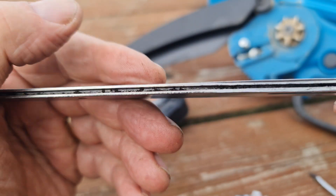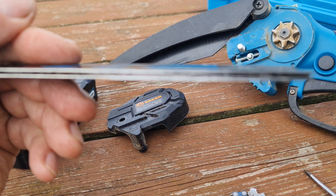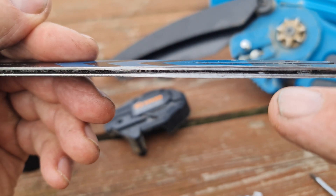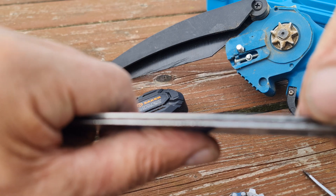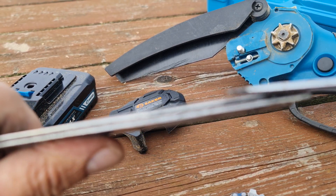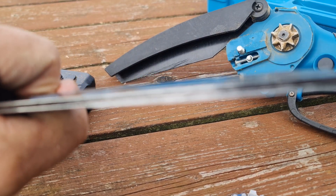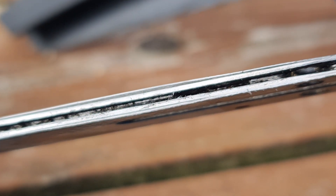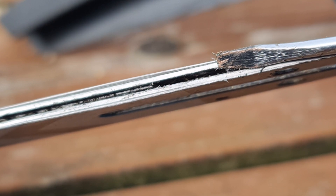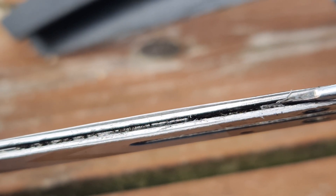What's happening is you can see it's wearing the blade and causing a bevel — it's worn down the blade right there. It's causing a groove on top and bottom. Can you see it? It's making the chain dig into it and the gap is shortening between here because the groove is bending over and jamming the blade, so the saw has to work harder.